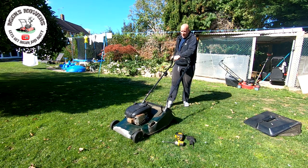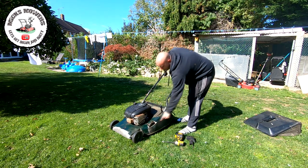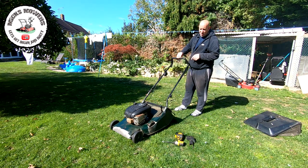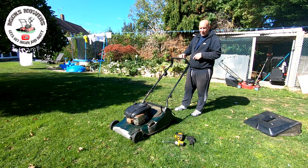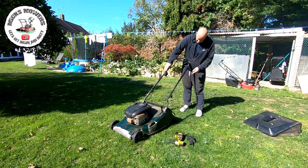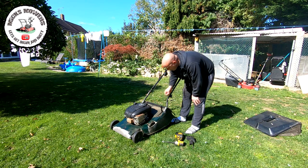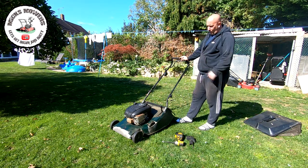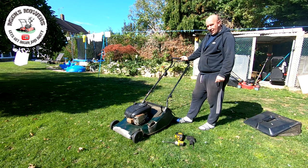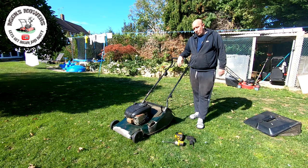On to full throttle. As you can see, the shaft here is spinning and the pulley is spinning, but when I engage the drive I'm tensioning up — it's just not quite right. The belt is trying to move but it's sliding. Throughout the time it's been running that belt has slackened off. You can adjust these here which is already at full adjustment, and you can adjust it here which is also at full adjustment. So there's no more adjustment to be had — hopefully the spare belt I've got will fit this.